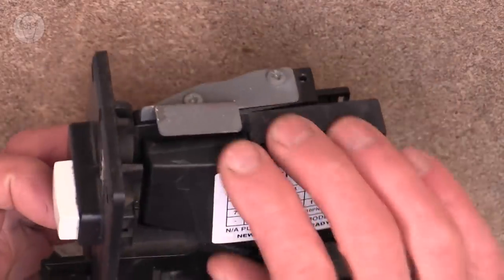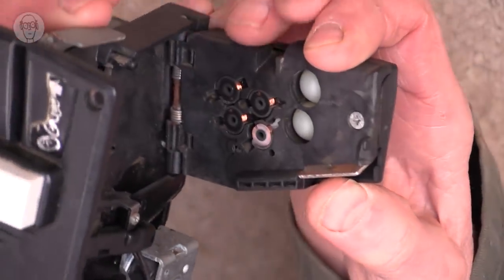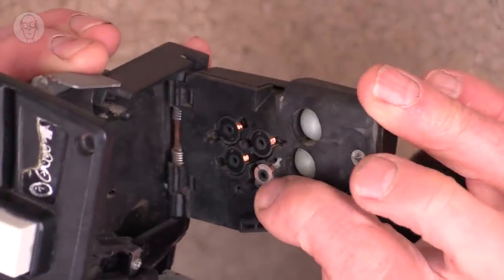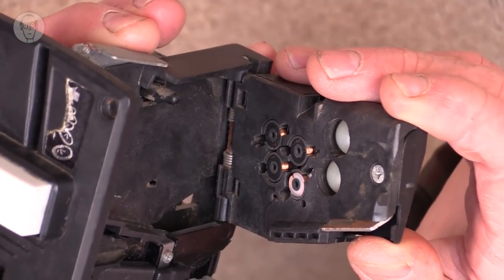The coin acceptors that I use on my machines also have inductive sensors inside. They're hidden generally, but on this particular model you can see them. There are these four coils of wire that the coin rolls past as it goes down the slope. And each different sort of coin generates a different pattern of electricity in the four coils. And so inside the acceptor, this is compared with ones in its memory to determine what coin has rolled down the slope.